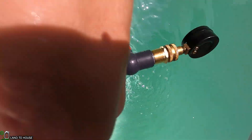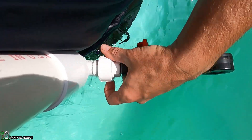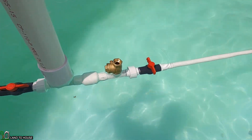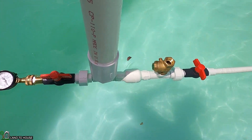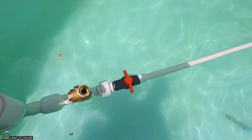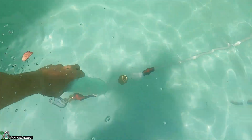Releasing the pressure so we can get the next test underway. Now it's time for the underwater test. I'm anticipating somewhere around 24 to 25 psi, just like the above-water test. I have the pressure primed, so I'm going to open up the drive pipe. The waste valve should start, and as soon as it does I'm going to sink this down to the bottom of the three-foot pool. We'll time this for one minute.